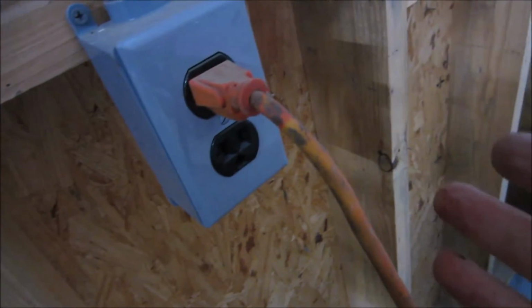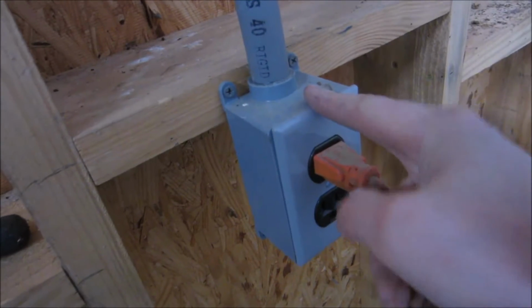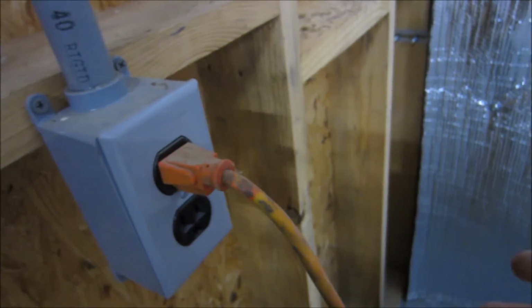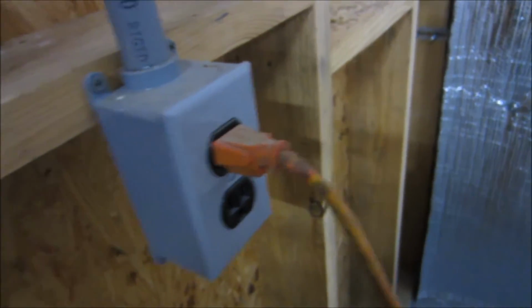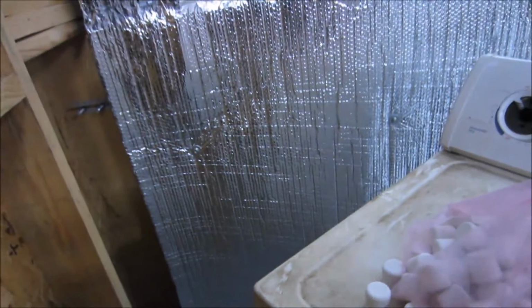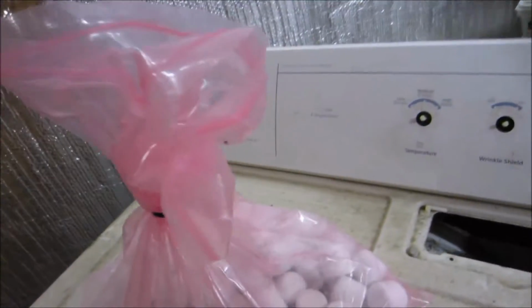I have this thing plugged in. This is a GFCI line. It's at 20 amps. There's a switch right there. Put a power strip in. It has its own fuse. There's also GFCI. You can flip a switch back and forth really easily and quickly in case something goes wrong. Usually even save like a shorted coil or something if it's actually a short.